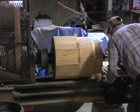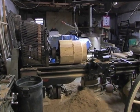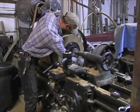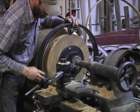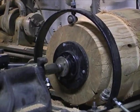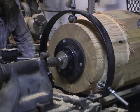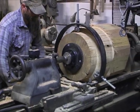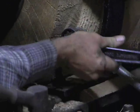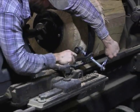What we need to do next is to bore a hole through the center. In order to do that we have to remove the rotor and the center bull nose. So we built this steady rest — it has bearings on each of three points that are heavy enough to carry the weight. We'll attach this steady rest to the carriage, position it in place, and the bearings will carry the weight and hold the hub in the position it's in right now.